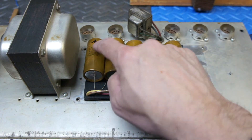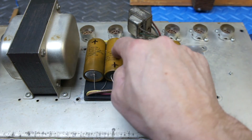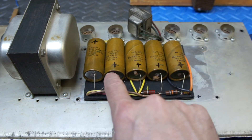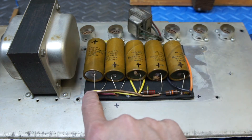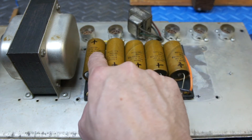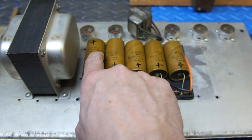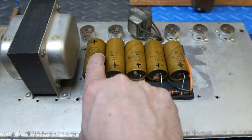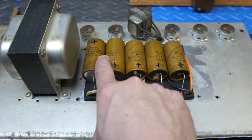This particular pair near the main filters is what they call a totem pole. The positive side is this end, and the negative side comes around — they're actually stacked. Because these each handle 350 volts, you're getting 700 volts of power handling for overloads.